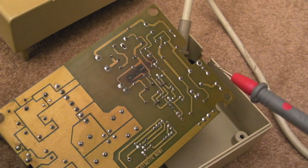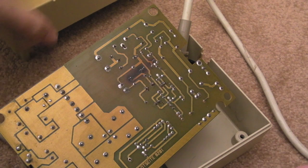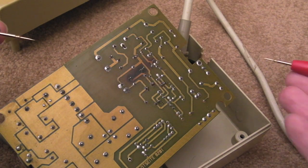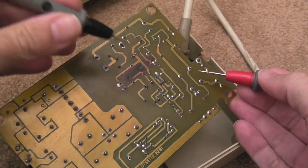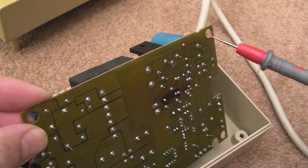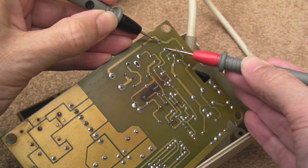So those capacitors made no difference. Now I've been listening to this, it's silent, completely silent, and switch it off and on, with your ear really close up to here. Got to be careful, don't do that the first power on, because if something blows up you could deafen yourself. But no sound whatsoever, which I think is suspicious. So I thought it's almost like there's no voltage, so let's power it on, which I did, powered on, powered off, very quickly measure the DC voltage here, nothing at all.